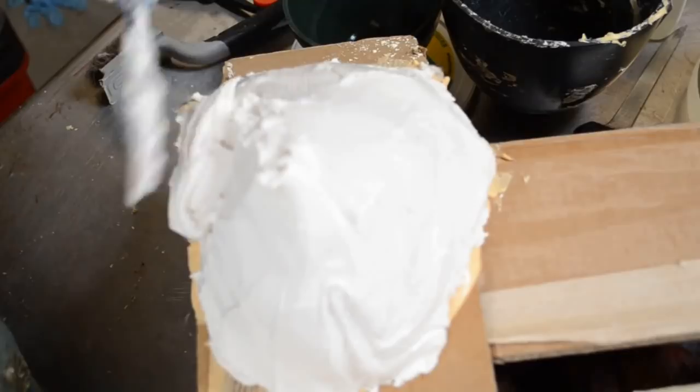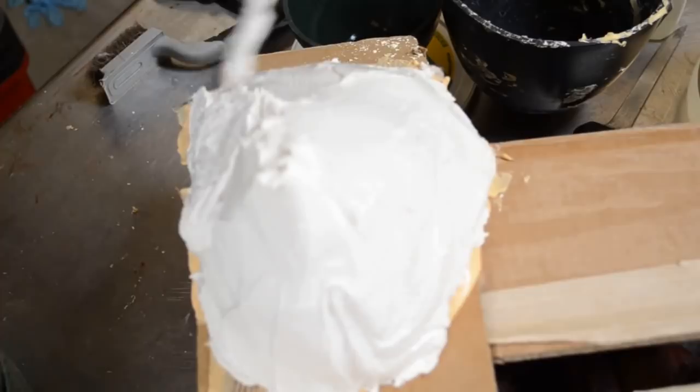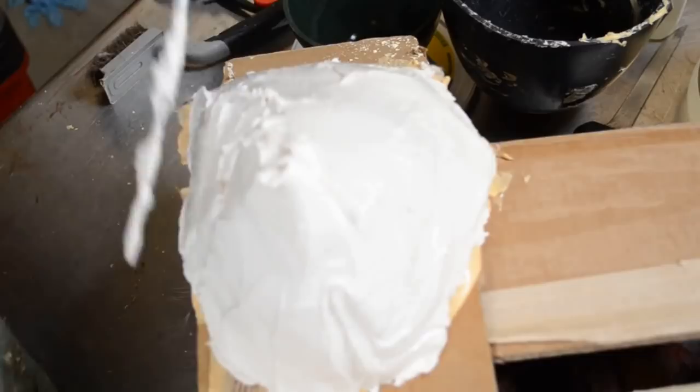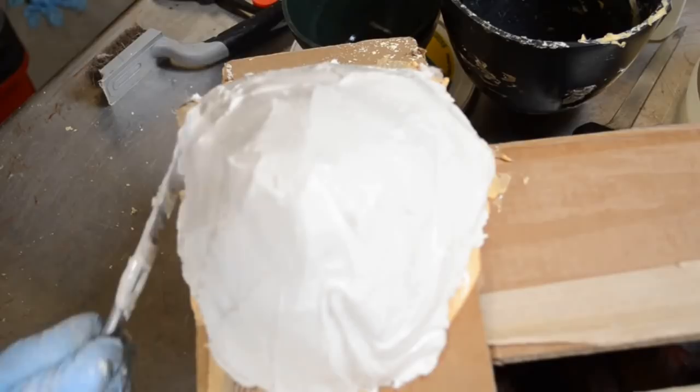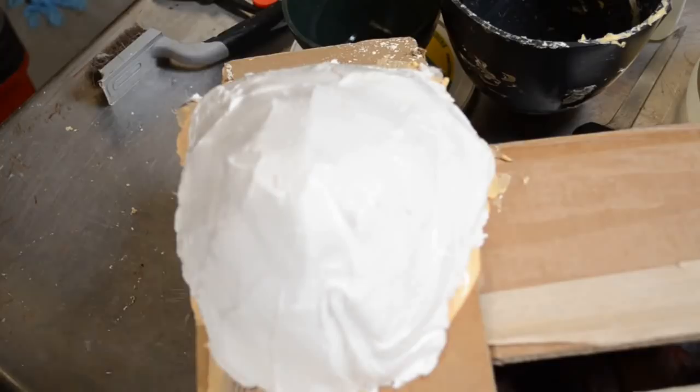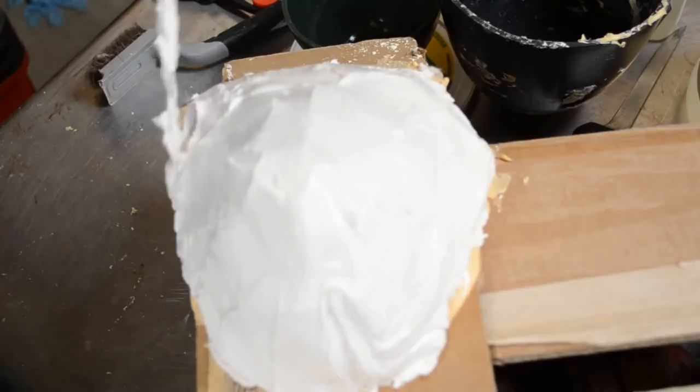See, now the dental impression alginate used to hold like the plaster. See how the plaster is going on? It's staying in place, it's not really running. And that's the way the dental plaster used to be. And I used to slow it down, like I say, by adding cold water from my refrigerator. All right, so if the ears are part of the mold, cool. If not, no matter. I know they're there. This is mostly for the face.